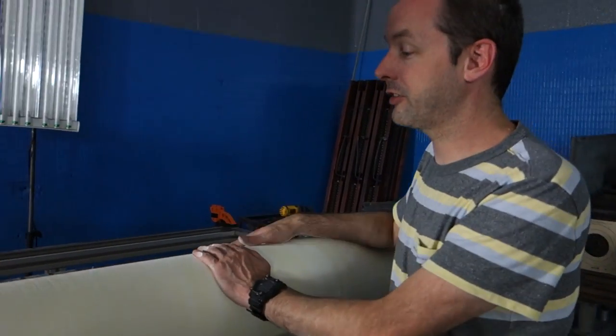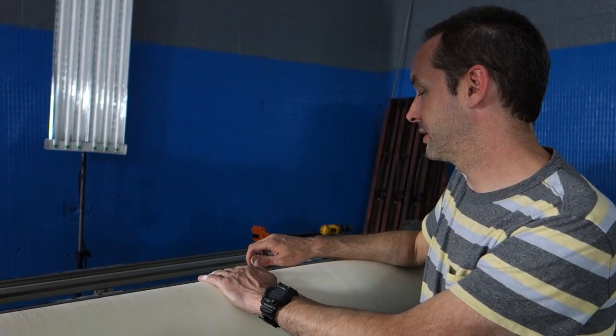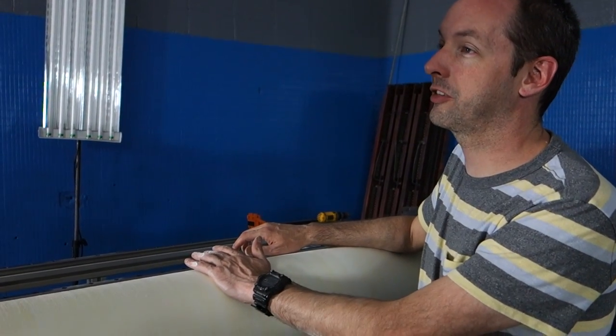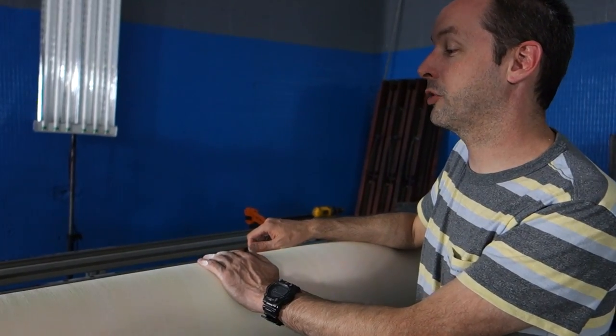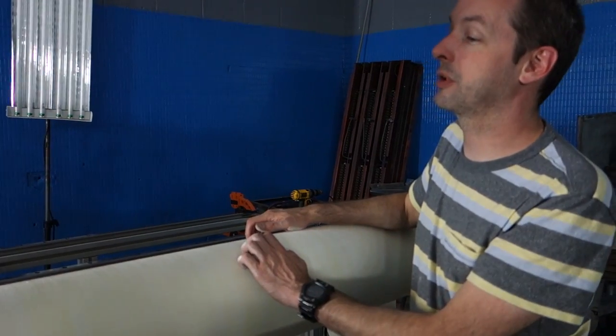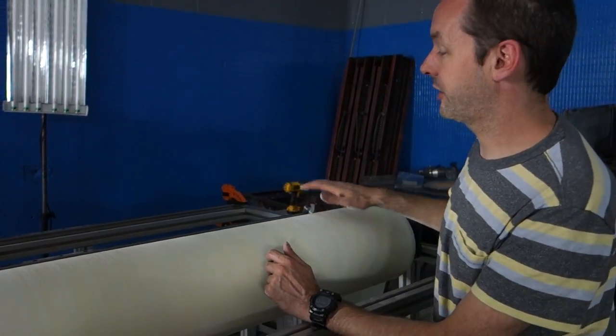And understand, it's an 8-inch coil that we're winding with only 22 gauge. Usually you go up a size. At 8 inches, I like to go about 18. At 10 inches, I go into about a 16. At 12 inches, I'm at about 14 or 12, depending. Gonna have so many lines on that. At 22 gauge, because that's all the wire I got is 22 gauge. This is gonna be a really high turn count. Figure it's an 8-inch coil.